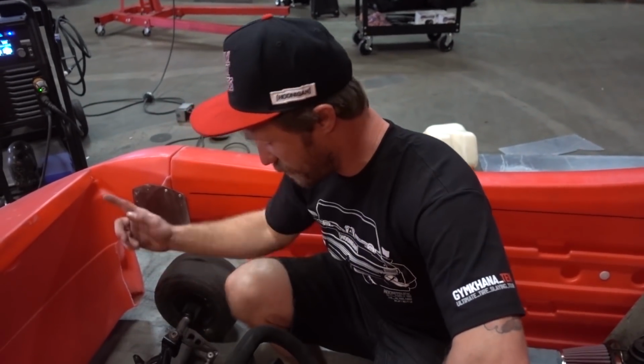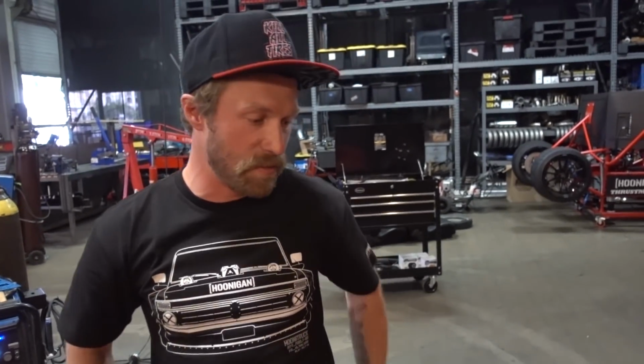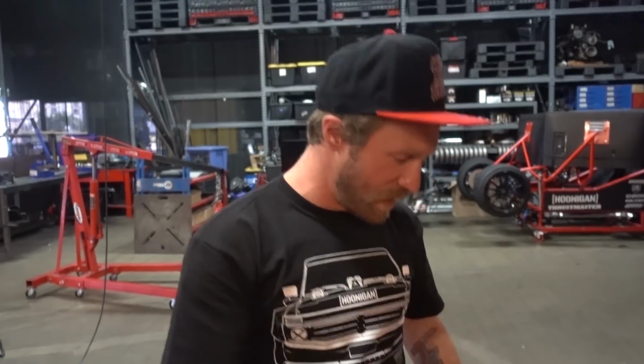Almost the rest of this would be made out of wood. So just a couple bars coming up. Brace those things in, a few gussets, I'll have you maybe cut some stuff out there. Then after that, what we're gonna have to do is worry about the fireproofing of it, because we're gonna have wood and we're gonna have plastic. So we're gonna have to build a box around the engine, but we also want it to get air and be cool, so we'll have to do some ventilation.